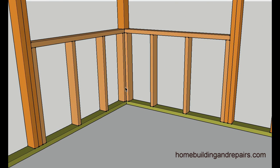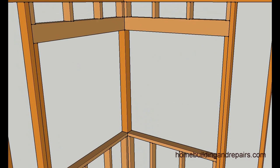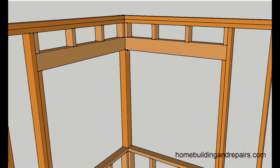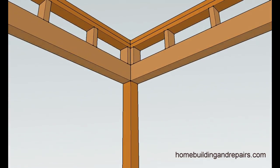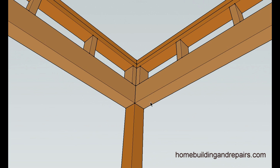Here's how the bottom section would be framed so that you have plenty of backing for drywall. The upper inside corner is again sitting on the four by four — everything dies into the corner. Here you would have a nice line coming out, and then of course you would drywall this or trim it out with wood, however you were going to finish it. Another view here just to show you where the four by four post is supporting the headers.